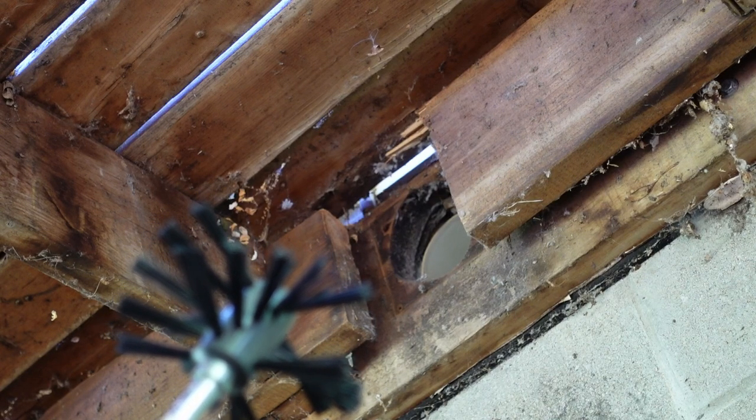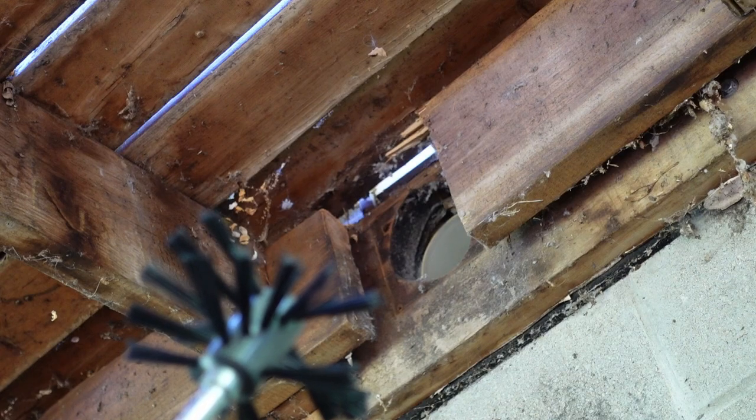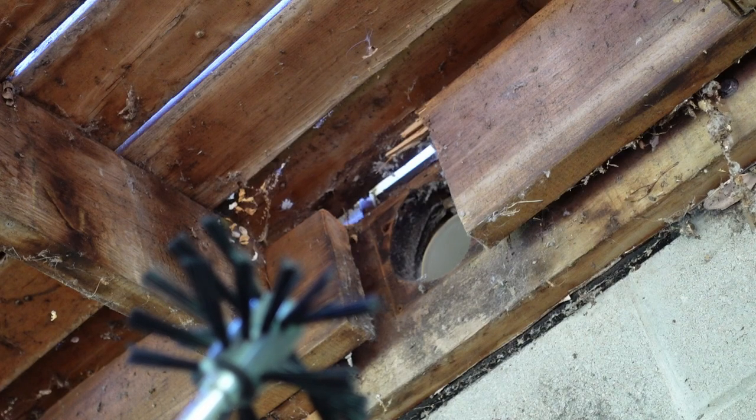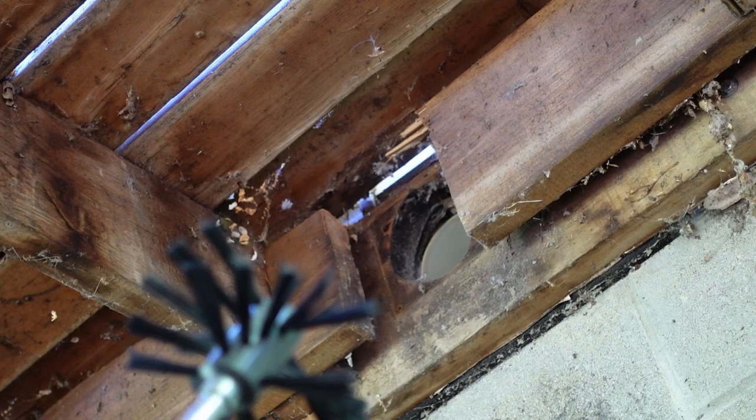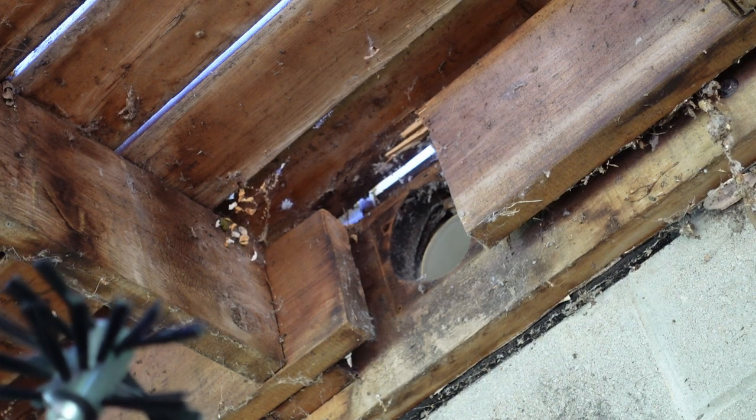What I may want to do is put an additional vent fan in to kind of assist, but that's a little more complicated than what I want to do right now, because I'd have to sense when the dryers are on or when anything's on using that vent, and then turn that vent fan on automatically. And that's just not something I'm prepared to do right now.